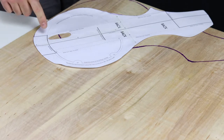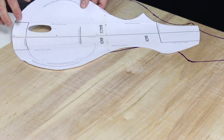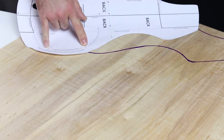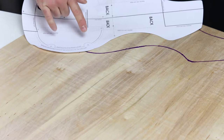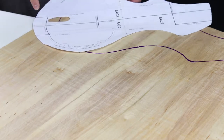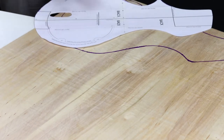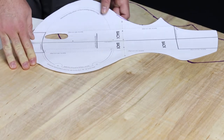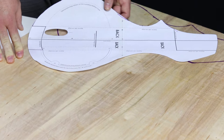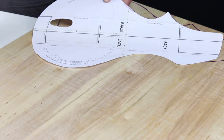But the screws will go through the plywood and into the oak. So they'll be locked in there nice and solid. All the screws, except for these two cavity cover screws, which, there's really not any strain put on those, but every other screw in this design is designed to make sure that it goes into the oak instead of the pine. So the pine is really just to fill out the space with as little weight as possible. It's really not relied on for anything structural, especially with the plywood sandwich on top and bottom. So that's partly why we do pine.